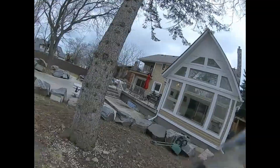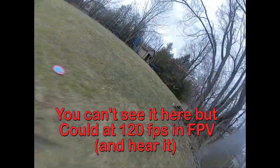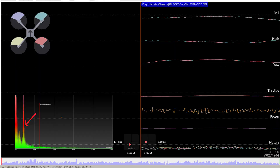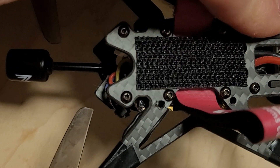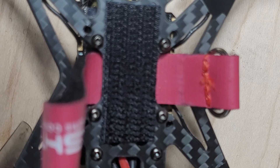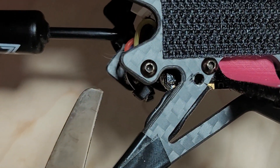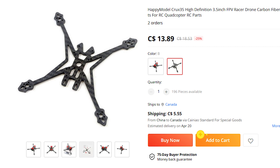All batteries had a resting voltage of 3.7 volts. I did bash this thing around a bit, but after a fairly light crash into a tree, I rearmed and flew again. I noticed at some point I was getting some mid-throttle fast oscillations, sometimes quite severe. Checking the props and motors, everything looked okay, and since I was in the middle of tuning I assumed I did something wrong and managed to tune it out a bit. When checking the blackbox, I quickly realized it had to be a hardware issue, and eventually discovered a crack in the arm causing it to flex really easily — a major design flaw that should have been obvious. It looks like Happy Model added an optional screw hole in the middle of all the arm struts, but in the back it's so thin that it makes it a significant weak point. The bottom plates are quite cheap, but this hole really needs to be removed in future cuts, or I might look for another frame if this happens a lot, especially if they break faster than propellers.